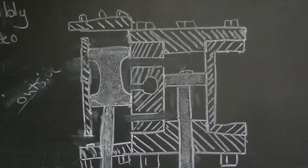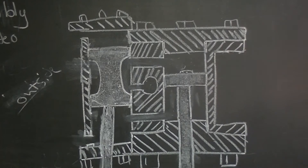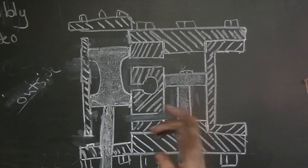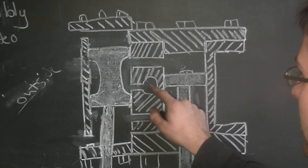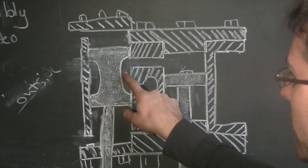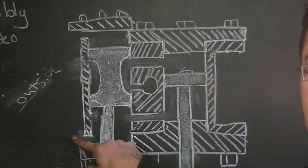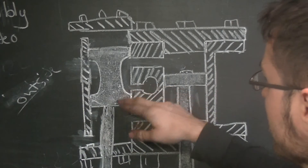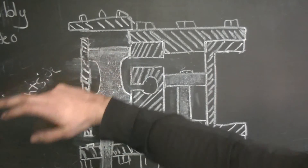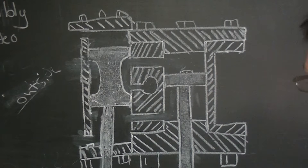What does work is the piston valve. Looking at the piston valve setup — nothing is drawn to scale — you can see it looks familiar. There's a similar U-shaped passageway. With inside steam admission, steam goes through the passageway to the top, the piston pushes exhaust out the bottom passageway, and as it moves down it flips — steam goes the other way and exhaust goes out the other exhaust passageway. It's the same operating principle as the slide valve.